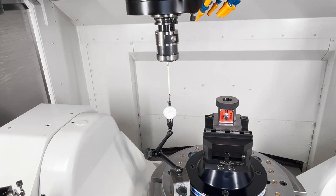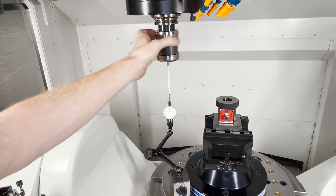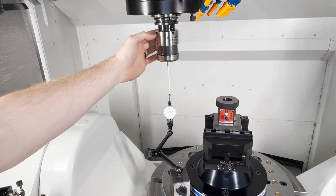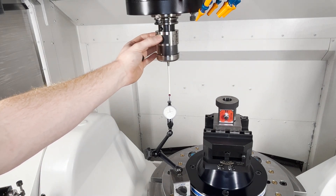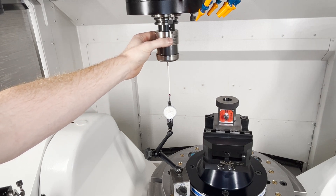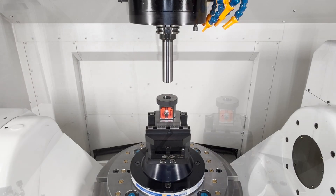The first step of Z-axis calibration will be making sure the ruby itself is on the centerline of the spindle. The way we do this is by putting in a mag base and an indicator against the ruby tip and then spinning the probe by hand. If you notice there is substantial deviation in your indicator when spinning the probe, then you need to adjust the ruby with the four set screws on the top of the probe body. Once you've done that and you have it where there is no deviation, go ahead and tighten down the set screws and make sure they're nice and snug so you don't get any kind of movement when the probe starts its routines.